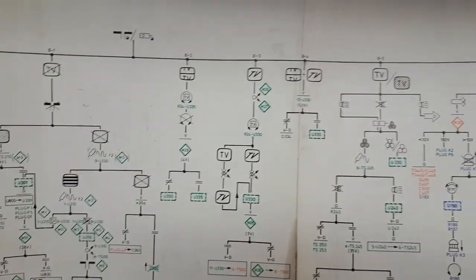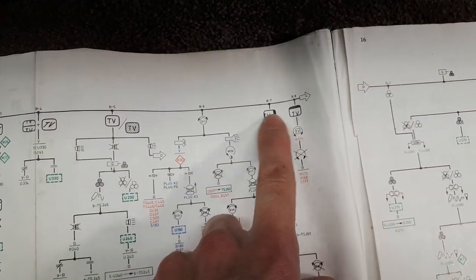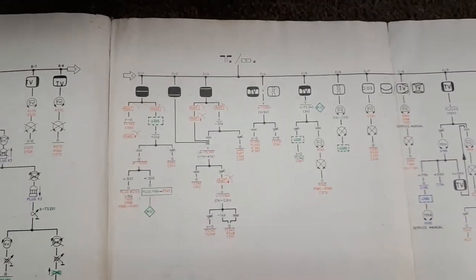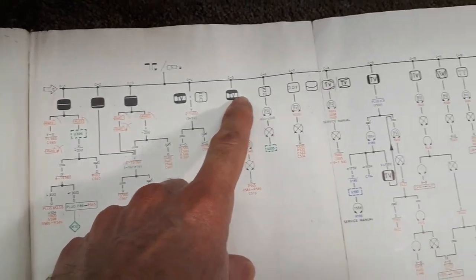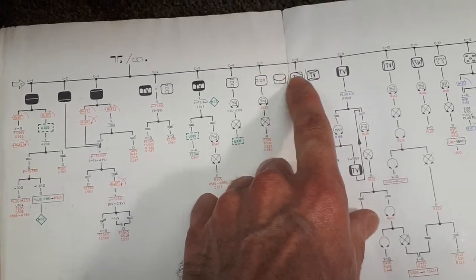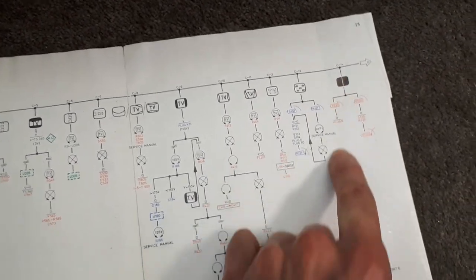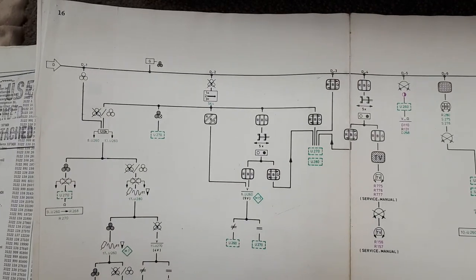So yeah, for everything, vertical hold, no horizontal sync. Horizontal centering's off, you know. There you go. Frame collapse, lack of vertical height, lack of horizontal width or pin cushion, east west, north south, east west correction issues, horizontal time base complete collapse. Really, really good.